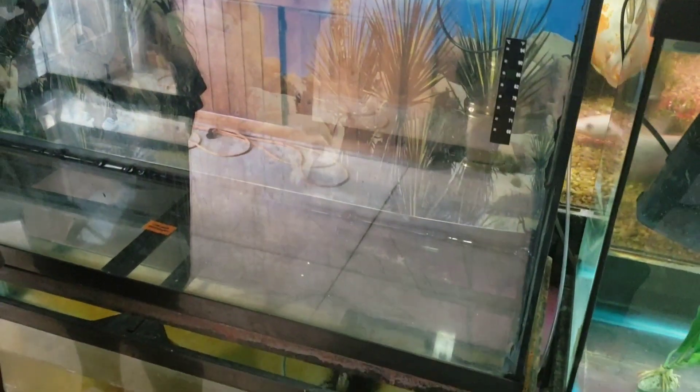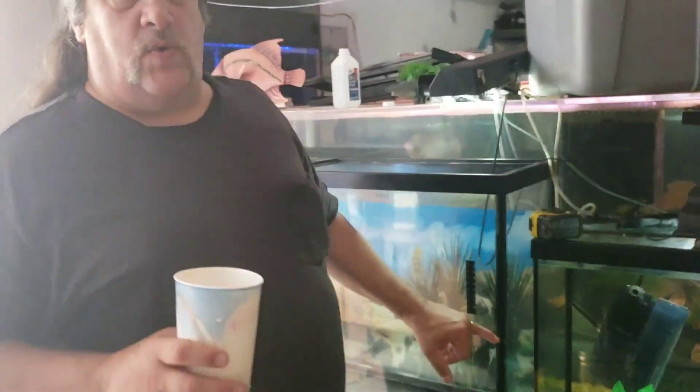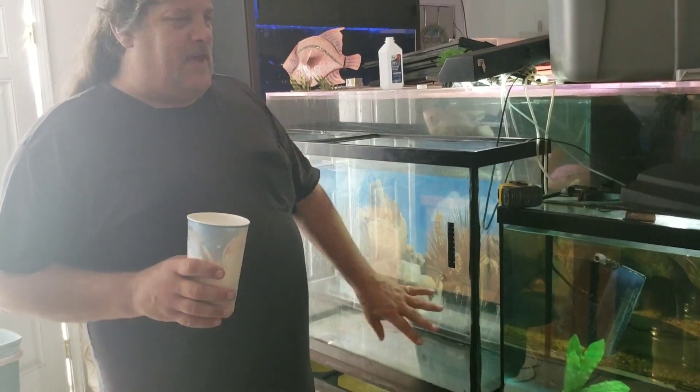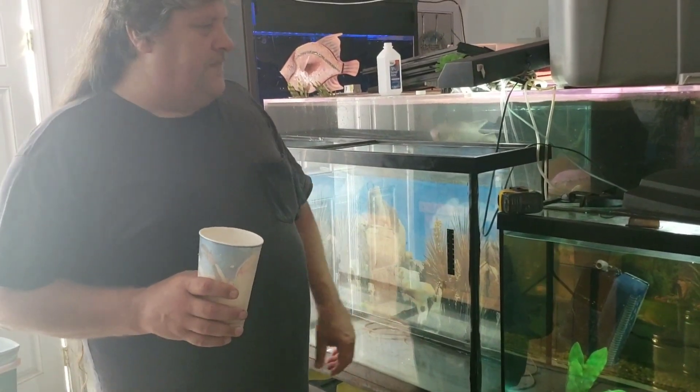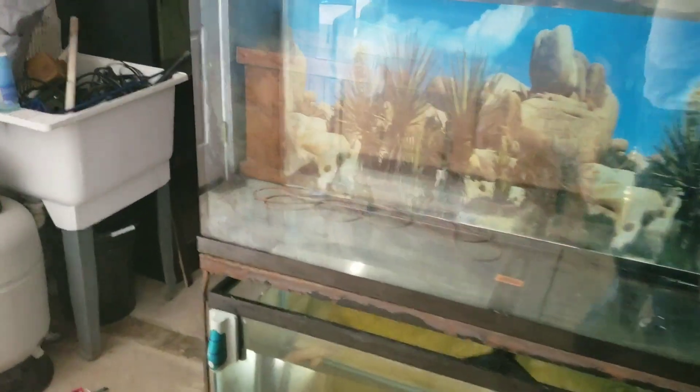I'm going to start smoothing out these corners. The corner bead is in — sorry I couldn't film it, had to move quick. The object is always to put the bead down and hurry up and smooth it in quickly. As you can see, it turned out not too shabby. Now you've got to let this dry for at least 24 hours. If there's a little bit on the window, you can go back and cut that off, but wait 24 hours — just let it set and let it do its magic.